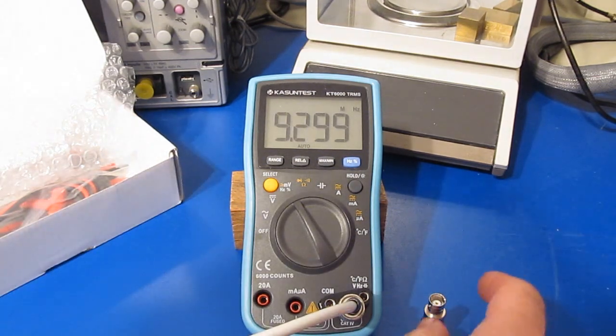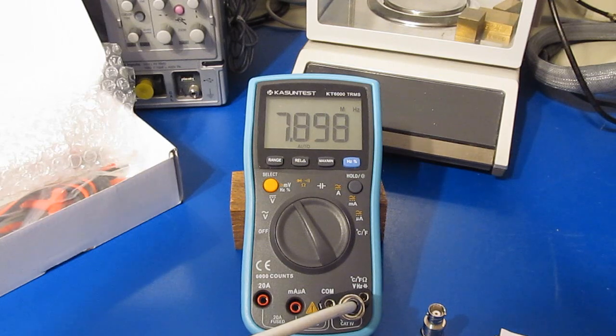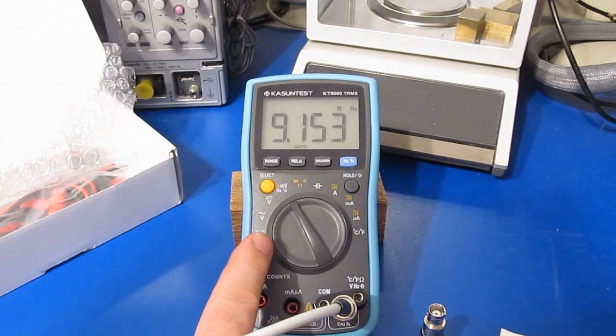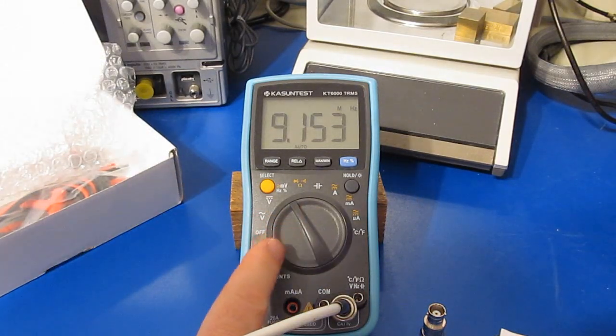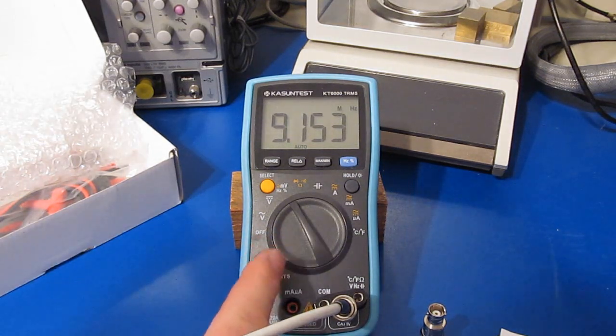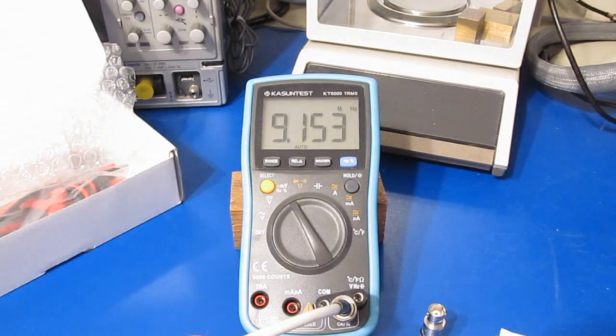This is pretty bad. So right now I'm putting out roughly 9.3 megahertz, but you can see the meter is very sporadic. This is 9.5 megahertz. Let me try the other RF generator. Maybe putting a little bit more power into it will help it pick this up. I can actually do better in some places with a lower amplitude than I can with a higher. So currently this is with 0 dBm, and it's able to read the 9.1 megahertz.